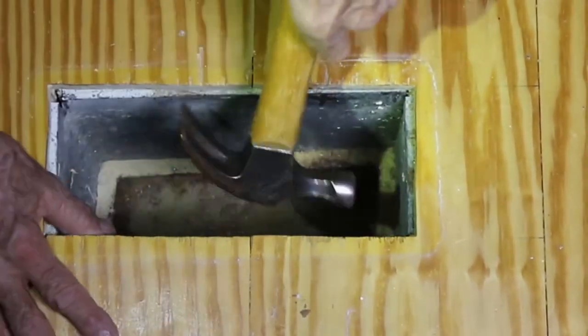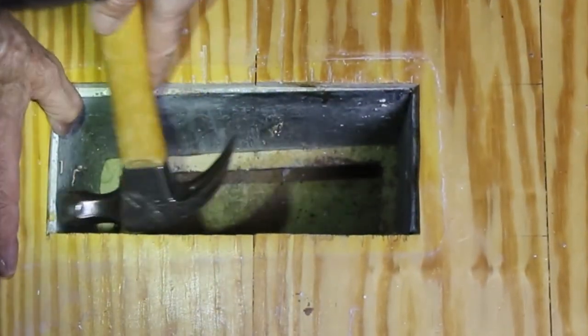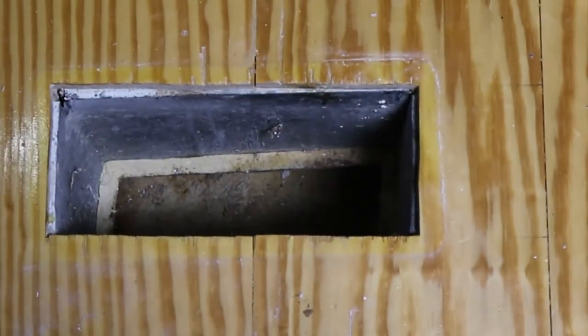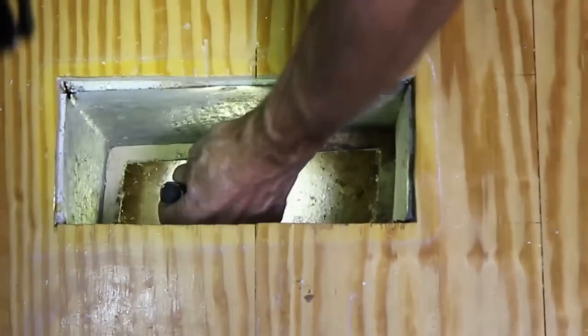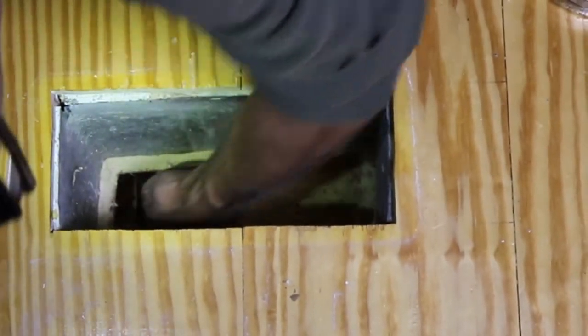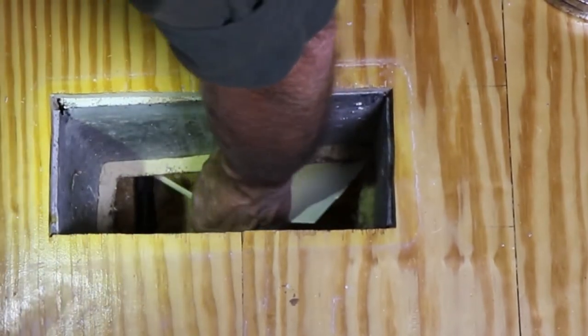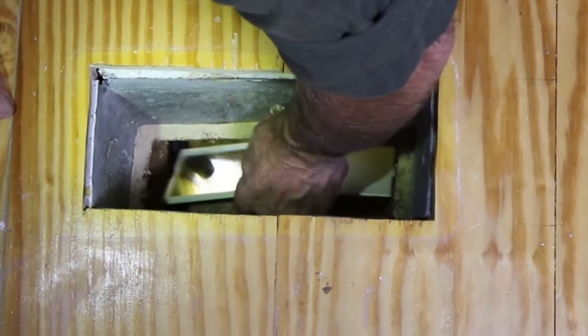After that's done I'm going to take a flashlight and shine that into the trunk line and I'm going to take a look with a mirror and just see if there's any debris down there, any junk, any garbage, anything that may be blocking airflow. There may be crushed ducts or holes. I'm going to identify all those things, seal up what I can, and clean it out where it's possible.